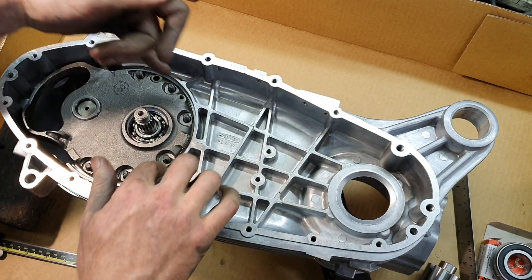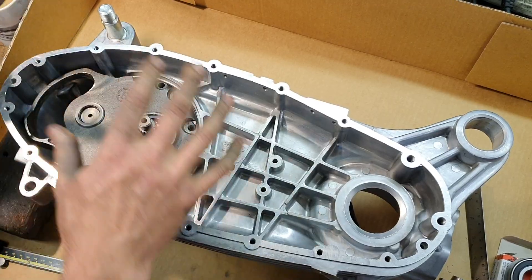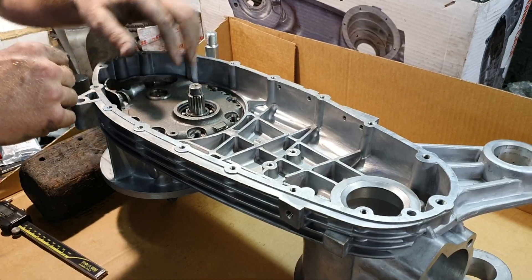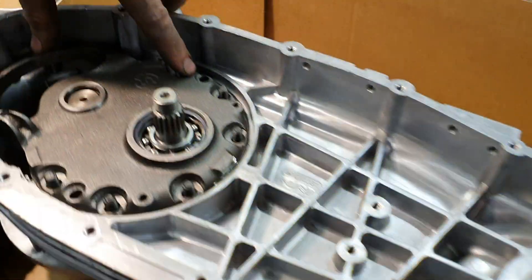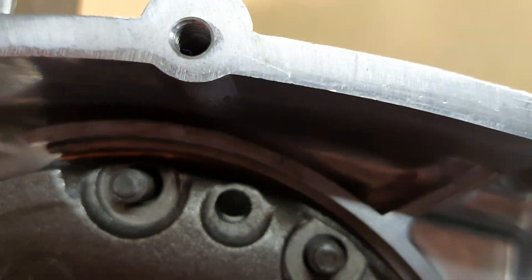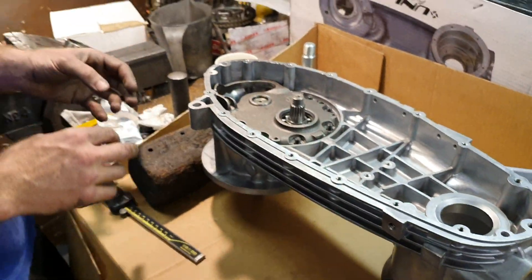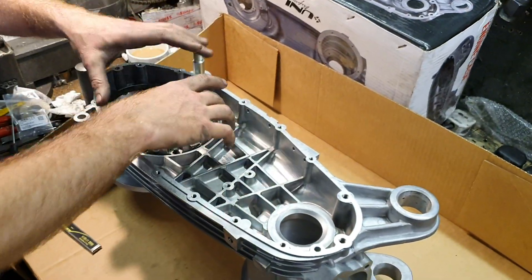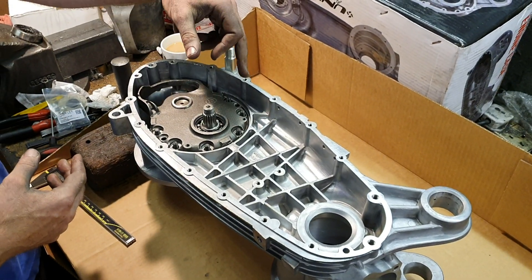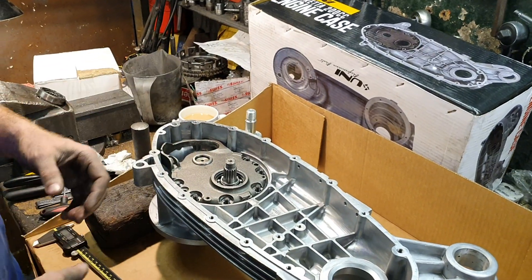I'd now tighten nuts and washers down on all six positions and then make sure I can still do that. Once I've got that locked down, now I can make the dowels do the job they're supposed to. If you look into this dowel hole, you'll see there's a nice overlap of material where the dowel does not line up with the hole — had I fitted the dowels, this end plate would have been forced out of location. So what we'll do now is drill those two positions slightly larger, going to 8mm, and fit an 8mm dowel in either position, then re-peen over the edge so that the dowels can never come out.